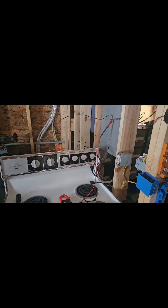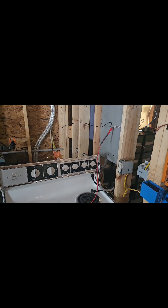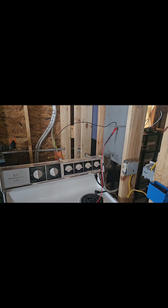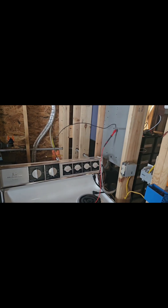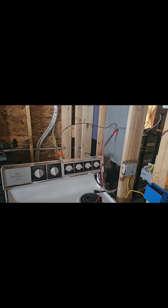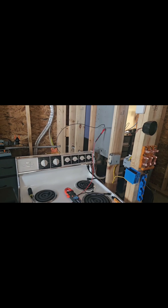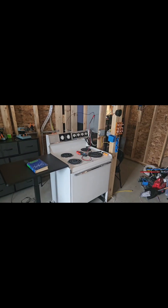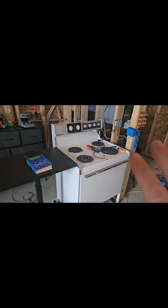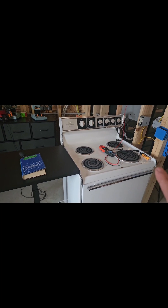Objectionable current is dangerous in a whole bunch of ways, but I don't think anybody in the comments section said why it was dangerous correctly. I'm probably going to do a longer video on this, but I just want to show this demonstration to start the ball rolling on where people have questions about objectionable current. It is to be avoided at all costs. It is dangerous, but it's not an automatic shock hazard unless the neutral fails. That whole setup of allowing objectionable current on the frame of a range and dryer was not a code violation until 1996, and it's still allowed in existing installations.